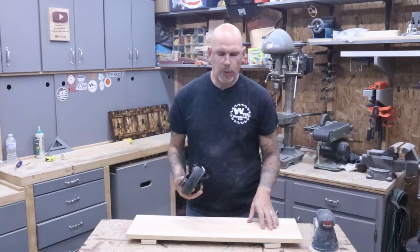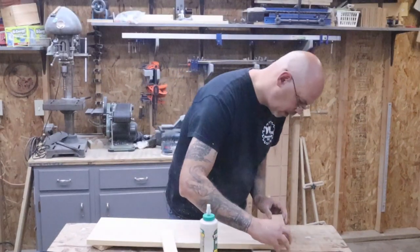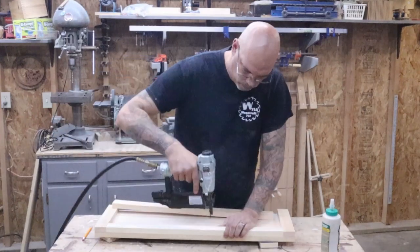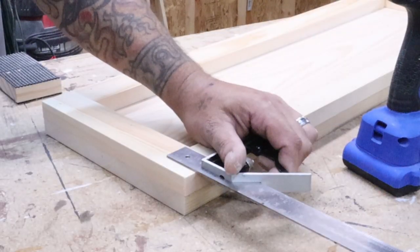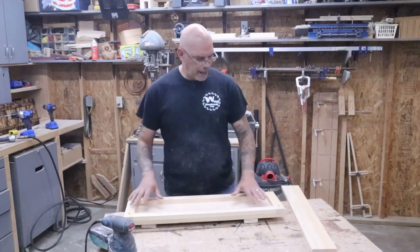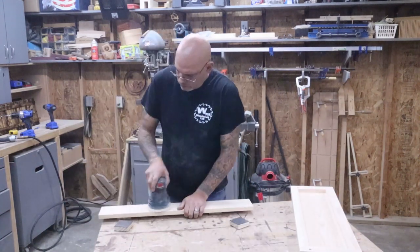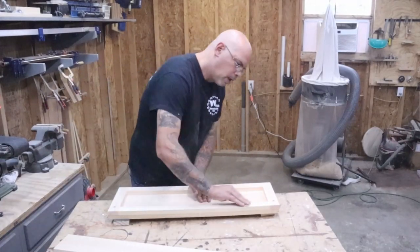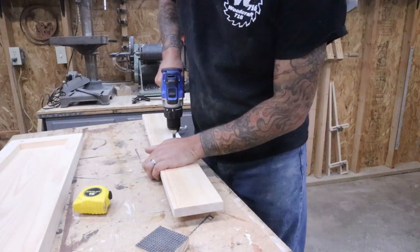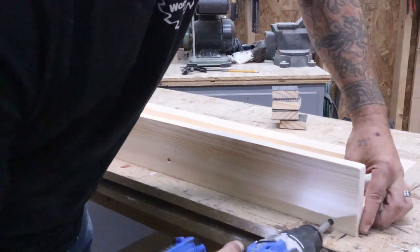We're going to give the back panel a quick sanding so once it's assembled we don't have to worry about that part. Then we'll take our side pieces, glue them on, shoot a couple of brad nails in, and nibble the longer pieces down until they fit. I'll come in an inch and a half from the top on each side and drill pilot holes for our anchors. Then we'll hit the whole thing with the sander, sand all the edges, and may even round off the corners on the shelf. I'll use hand sandpaper to take off the sharp edges, then come in an inch and a half from each end, mark the center of the backboard, drill countersink holes, glue it, and put our screws in.